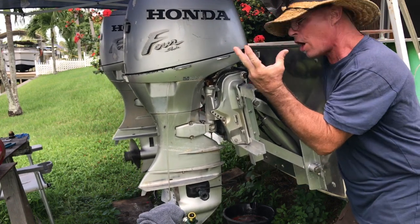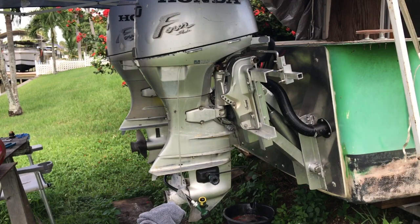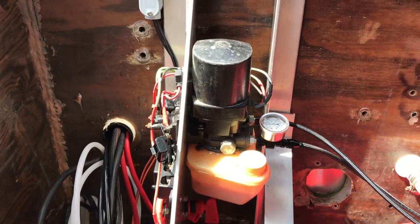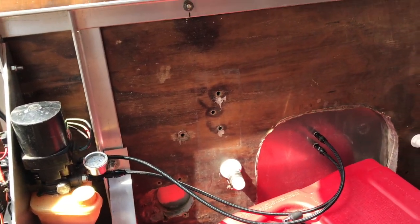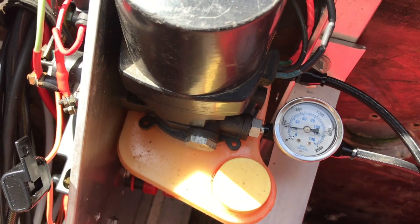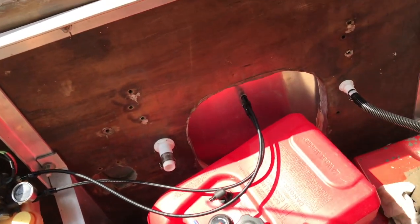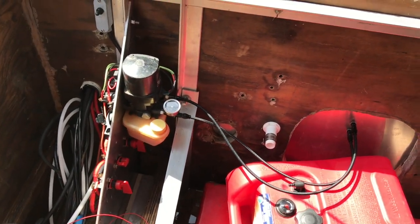We shall rise above — we are invincible! Ha ha! So this is the pump, it's a Parker model that MerCruiser has used for many years on their stern drive models. Now we are operating and holding at a leisurely — looks like about 275 psi — and that's pretty much nothing for hydraulics, so very little strain on the whole system.